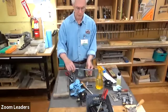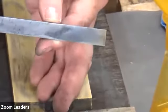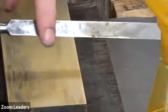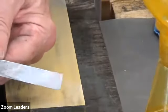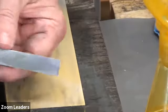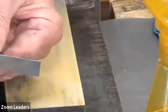This is a great chisel. It's a Witherby paring chisel that we got at that place in Westmoreland. But the back, all this area here, is pitted. You've got to get through that. It doesn't matter up here, but close to the tip, you have to get there. And here you can maybe see another little problem. I've done it on the 1,000 stone. It's been sharpened before. I polished it on the 8,000.